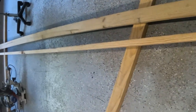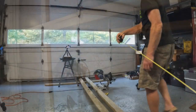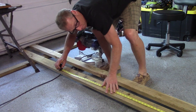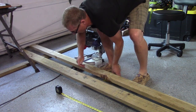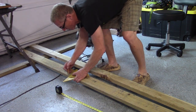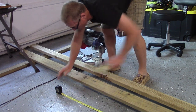The first thing I'm going to do is take these two 16-foot treated boards and cut them down to 12 feet 4 inches. This ladder is going to be almost vertical but at a slight angle, and we're going to dig it out and put some rocks at the base so that the bottom of it doesn't rot out as quickly.